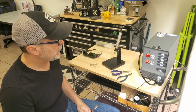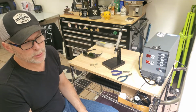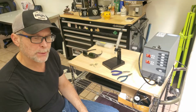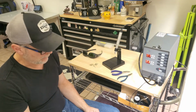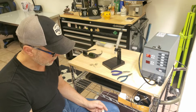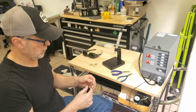So today I'm going to start by running some welds. You'll notice when I run these welds that they will be anywhere from 1 millimeter to 1.5 millimeters, maybe just a tiny bit bigger, maybe 2 millimeters tops. If you put the micrometer on it, you'll see that they're not very big welds. I'm going to start at this lowest setting and run welds down this piece of metal, and then I'm going to show you close up how it looks.